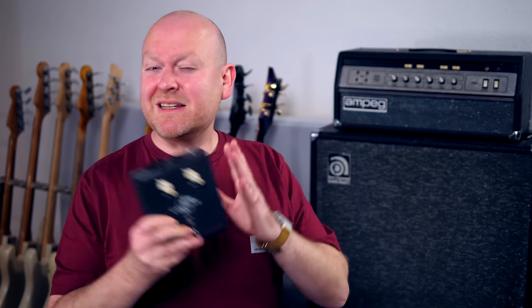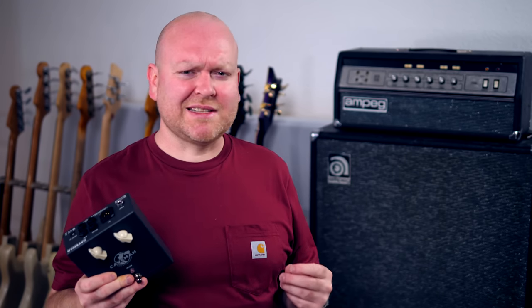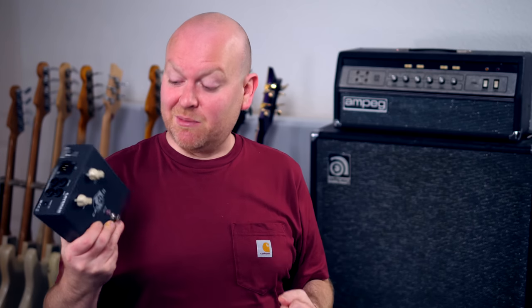The effects loop in here is not switchable as in the big pedal, but that's fine. Behind the input sits a buffer, which you kind of want to be the very first thing in your pedal chain, so the effects loop sits in between this buffer and the preamp. The only exception for me would be certain fuzz pedals — some of these famously want to be even first in your pedal chain, so those would in my case go before this preamp. And by the way, the switch is a mute — this pedal just never needs to be switched off.